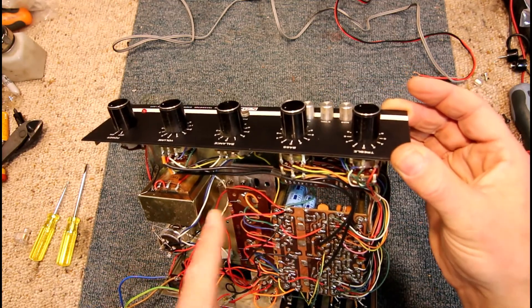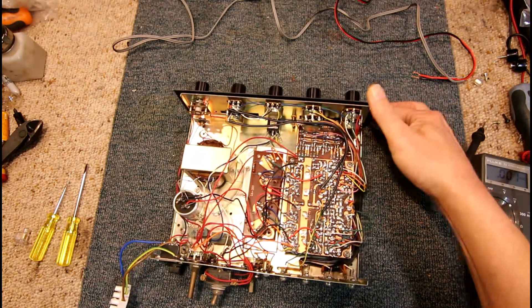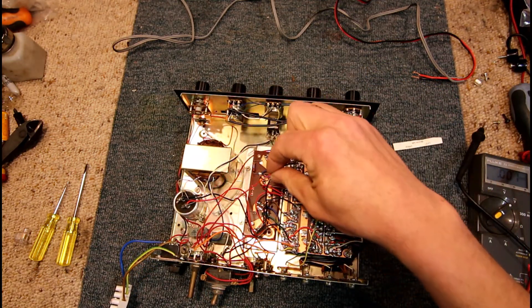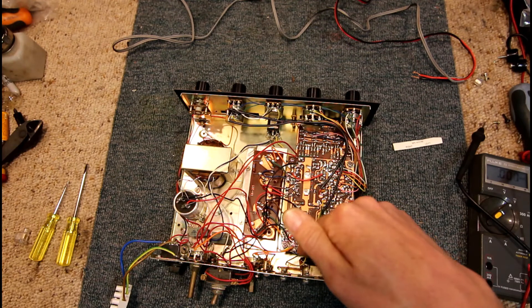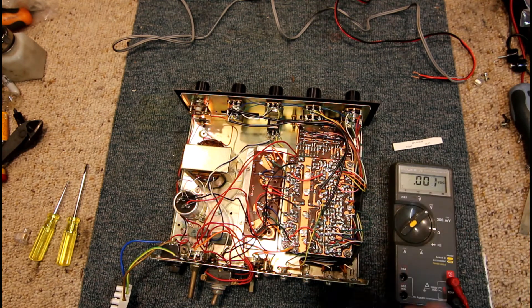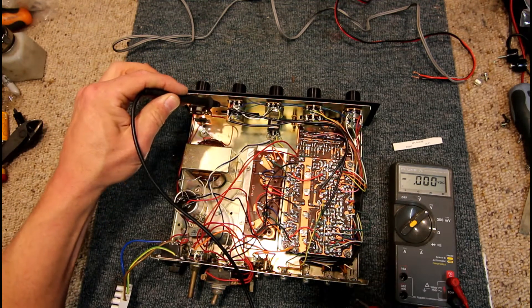There's a green wire from these reds that goes down to the headphone socket. Here we go — blue and white. So we're going to use the headphone socket to work out where the original speakers went. These red wires have all been added later. I might get rid of all this rubbish so I can see what I'm doing. There's a yellow wire from this end of the board and a filter cap there, so this is probably going to be DC isolated anyway. I'd assume the case or even the pots are usually a good ground.